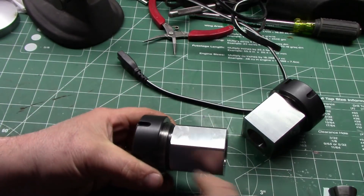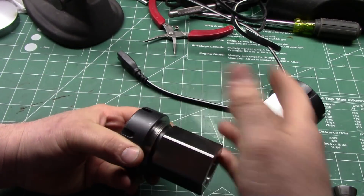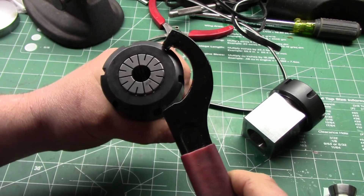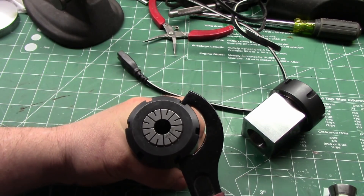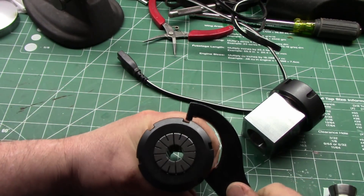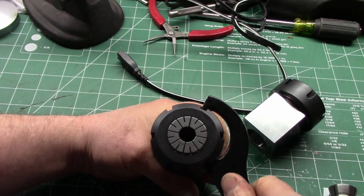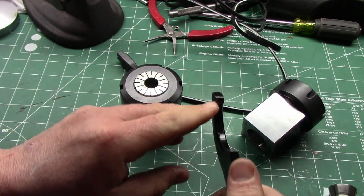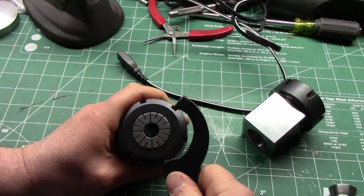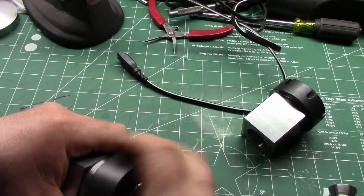The major drawback is that this nut is bigger than the body — on a 5C that won't be the case, the body will be the same size — so you do have a somewhat large nut on the end to contend with. For whatever reason it doesn't quite fit the wrench as forgivingly as a standard nut I have, and I could probably give the slots here a quick little polish, but it's a little harder to get in and out. It works though.